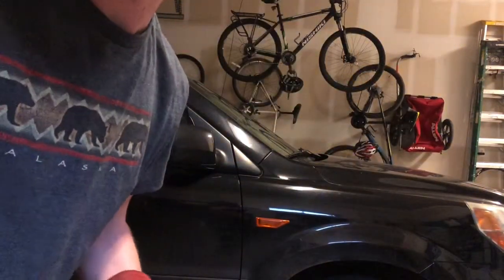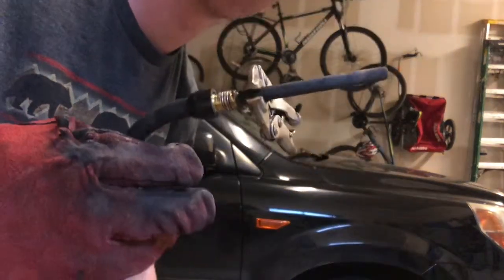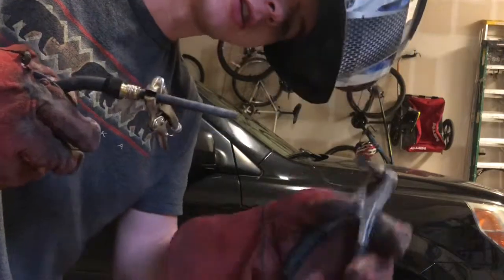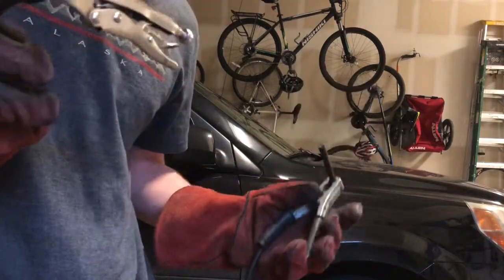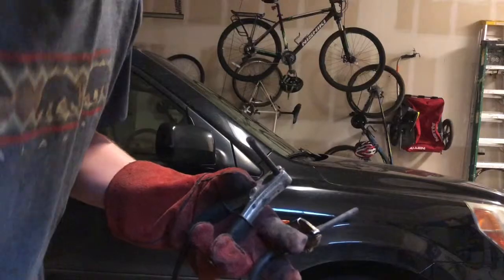In this video I'll be showing my super sketchy carbon arc setup that I made from my welder. I have two carbon rods — one is connected to the tip of my MIG welder and the other is connected to the ground. When I touch them together they should create an arc. This one's a new one and this is an old rod, but let's get to it.